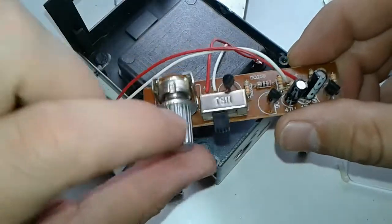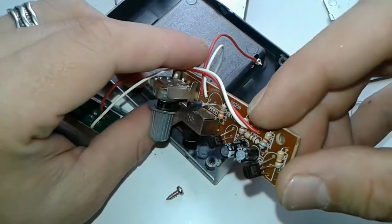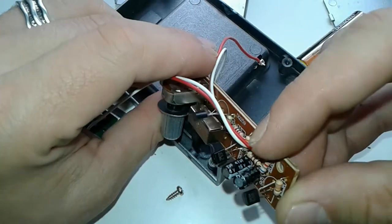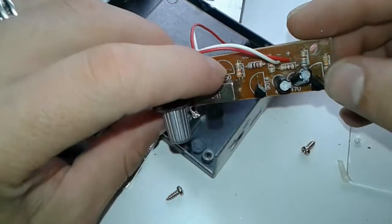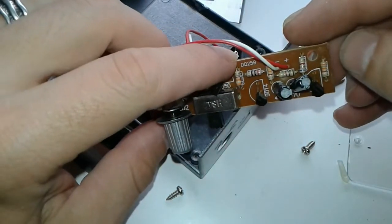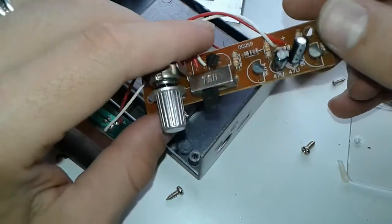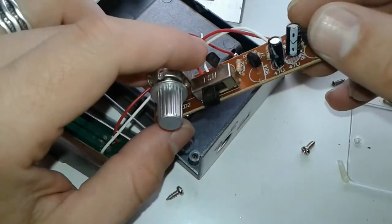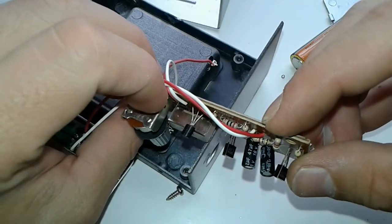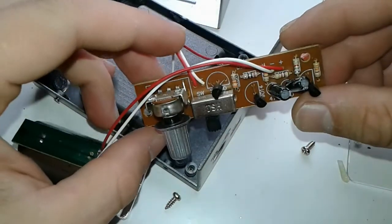You know, on, off. This is the pot that's regulating the speed. And it's got three transistors, which are S9014C331. Yeah, all of them are alike. One, two, three resistors have the same value, and three of them different values. And the capacitors are 16 volts, 47 microfarads. There you have it. We're gonna try to deconstruct this diagram.